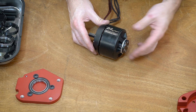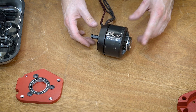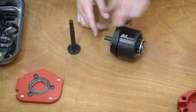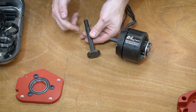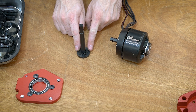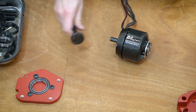Before we do all the assembly, we should talk about the motors first. This started out its life as a Maytec 8085 and has gone through a couple of modifications and improvements. Most notably is the shaft itself — if you've been watching my channel, you've probably been seeing some things about this. This is a solid one-piece shaft with a flange on the back, all made out of 4140 steel. We've got a hex on one end, and then this flange with the five holes on the back.